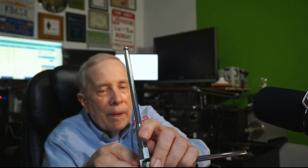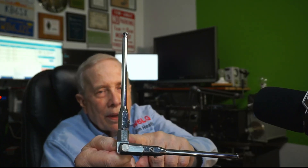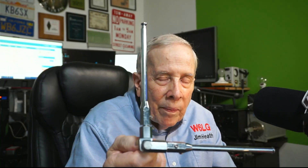Let's say we want to configure this as a vertical. So we're still talking about a dipole. Here's my sort of clumsy vertical. I watched a guy's video today and he referred to the radials as an RF ground — they're not an RF ground, they're the other half of the dipole. So this is a quarter wavelength. Like on the DX Commander, he's got several quarter wavelengths, and radials come out — basically it's forming a dipole. The impedance, because it's being fed in the middle, might be 50 ohms and may not require any matching.